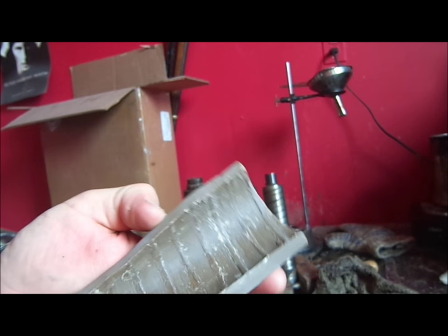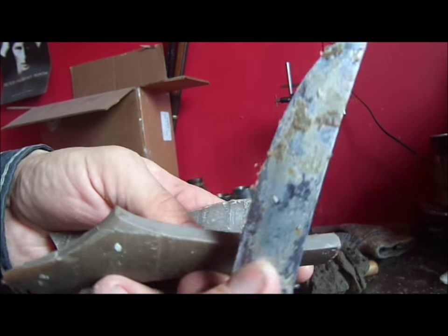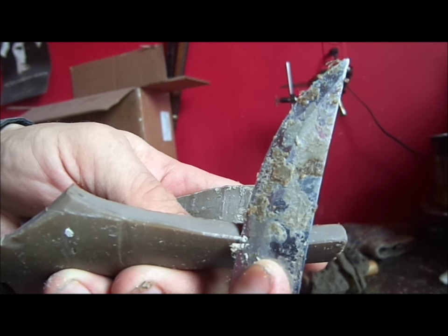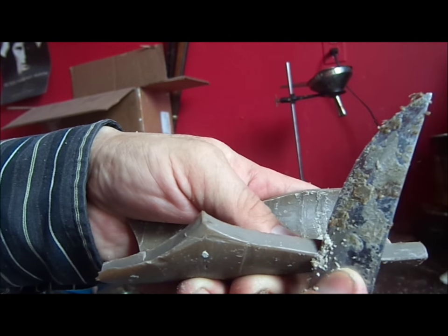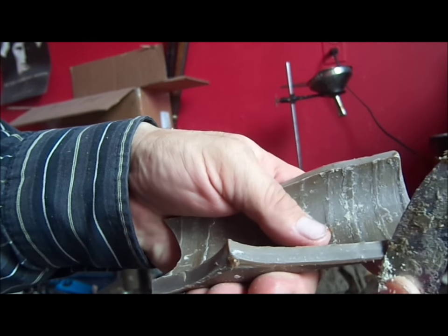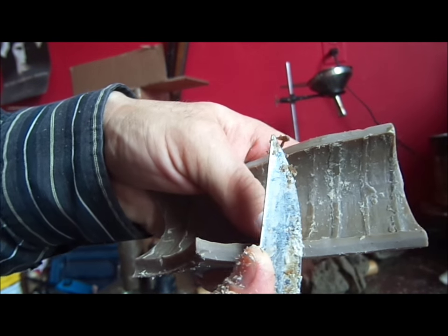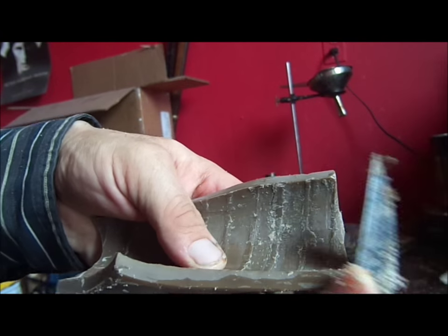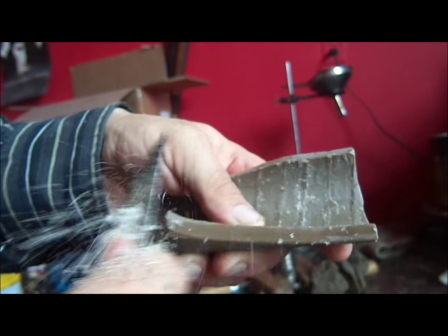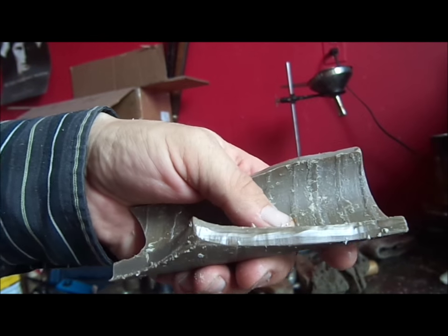Now, some elements to know about with wax to test them is that when you take any type of a blade to it, you should get a nice curly shaving that's slightly powdery. Slightly powdered, but yet kind of curly shaving. You notice that it comes off, but yet has a little bit of powderiness to it. See how that shaving comes off, just like you're shaving a record.